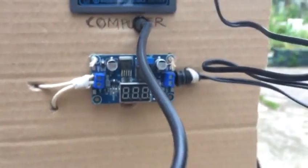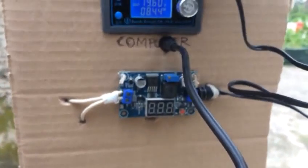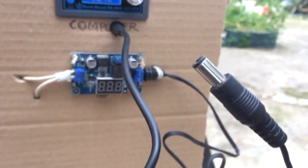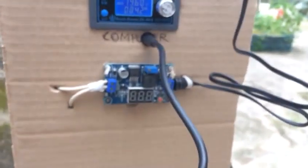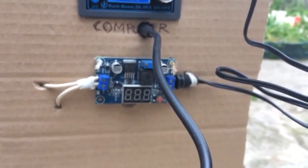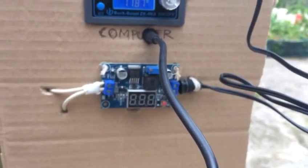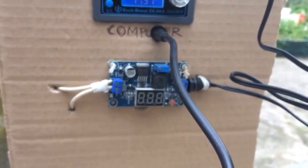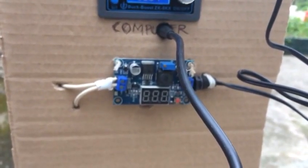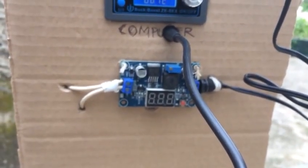The other circuit which I have here is switched off. I use it for operating my musical keyboard — it has this kind of jack. It's just a voltage stabilizer to make sure the keyboard is operated with exactly 12 volts, because the battery can be a bit more. If a car battery has less than 12 volts, it means it is either broken or needs to be recharged, so you better not use it.